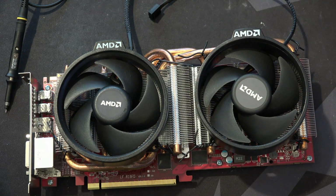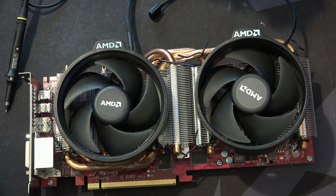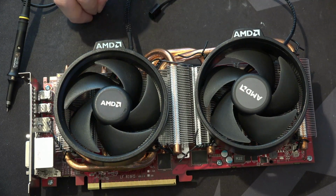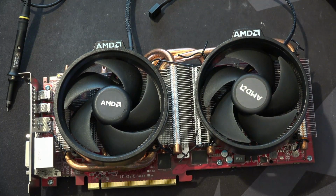but I have run into a situation with, say, my X299 Micro 2 where I was making this motherboard do a certain set of memory settings no matter what. I did volt mods, those weren't enough. So eventually I added a bunch of capacitors, including two of the 1200 microfarad RS8 series caps on the memory rails. This was fine until I tried to set 2 volts DIMM voltage. With that much capacitance on the output of the memory VRM, it would trip the overcurrent protection, and sometimes it would shut down the memory VRM before the board would get into the POST process.